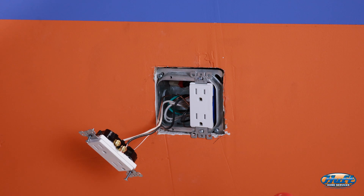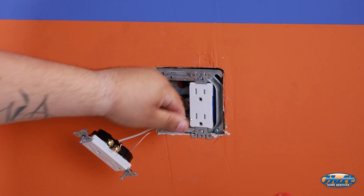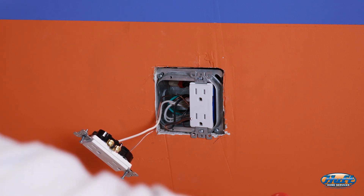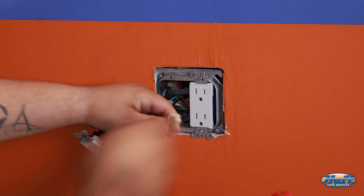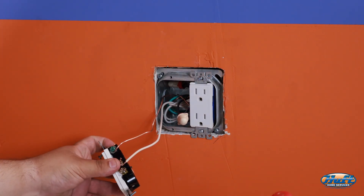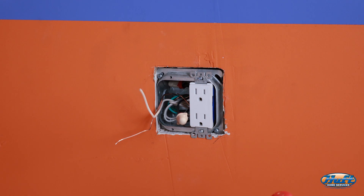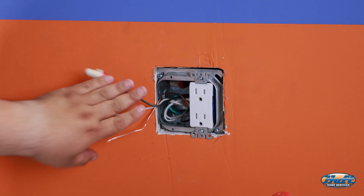I usually cut off the wire end because they already have a loop, and some receptacles don't require a loop. Start with the black wire — take it out and, as an extra safety step, grab a wire nut and cap off the hot wire, which is the black one. Then do the same for the white wire, cutting the end back. Finally, do the same for the ground wire. Keep the wire pairs together.